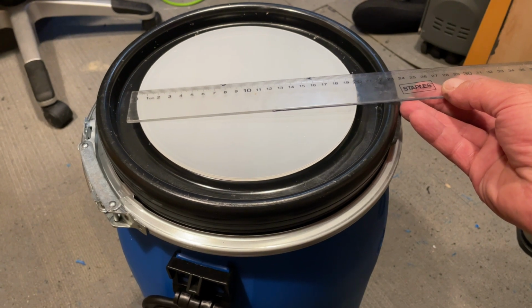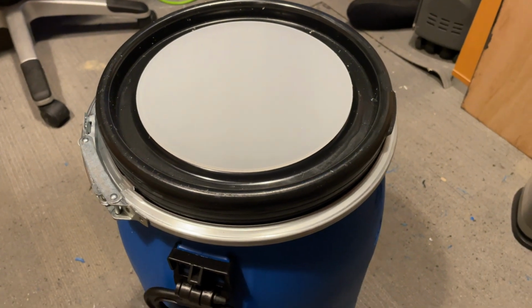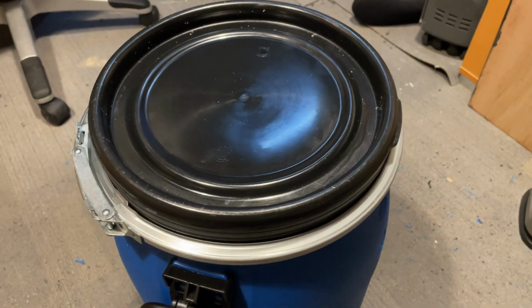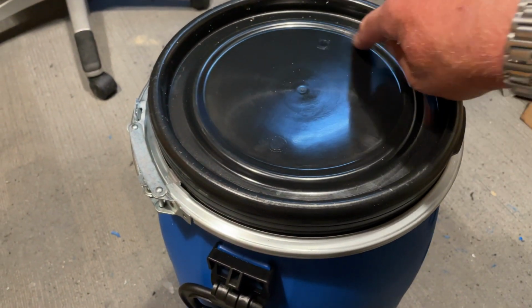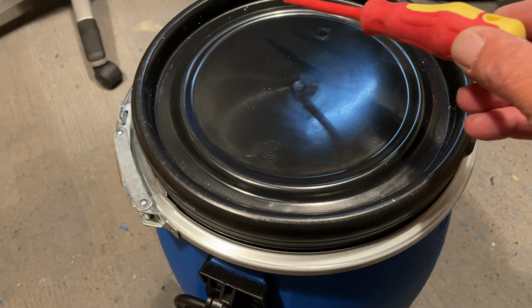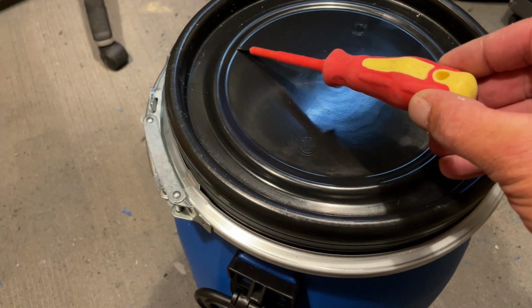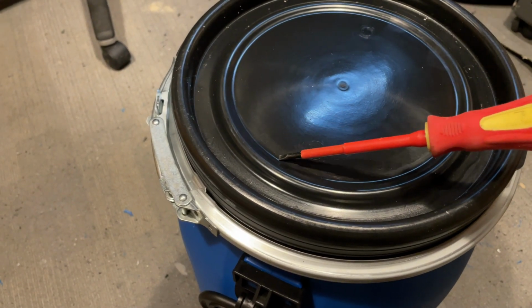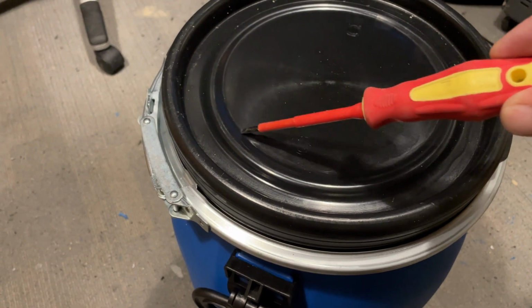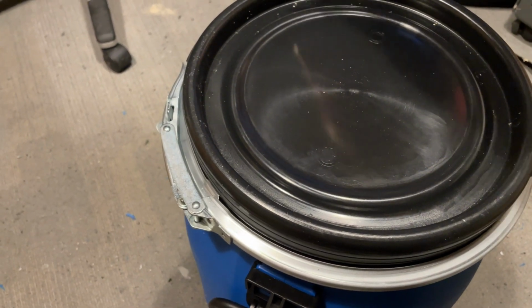These are 20cm discs, thereabouts, close enough for me. They are, however, actually very well fitting for the purpose for which I've bought them. Once you've cut on the inside ridge, you're cutting on the inside edge at the bottom of that ridge, all the way around. If you're lucky, like I was on the first one, the jigsaw naturally follows that contour because the plate at the bottom of the jigsaw rubs up against it and follows it all the way around. Very fortunate.